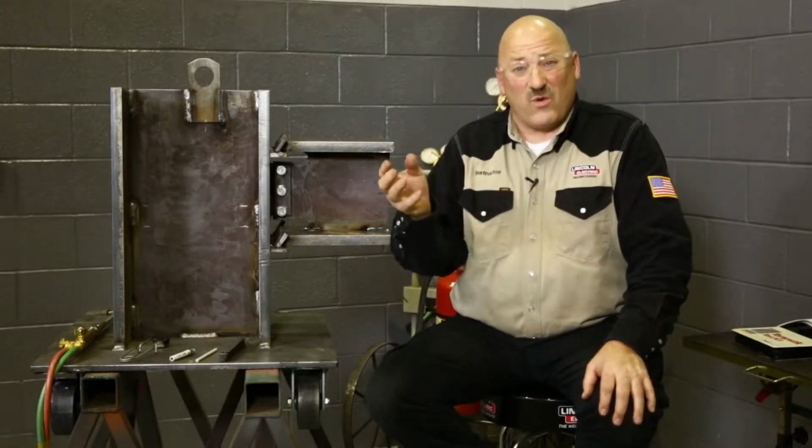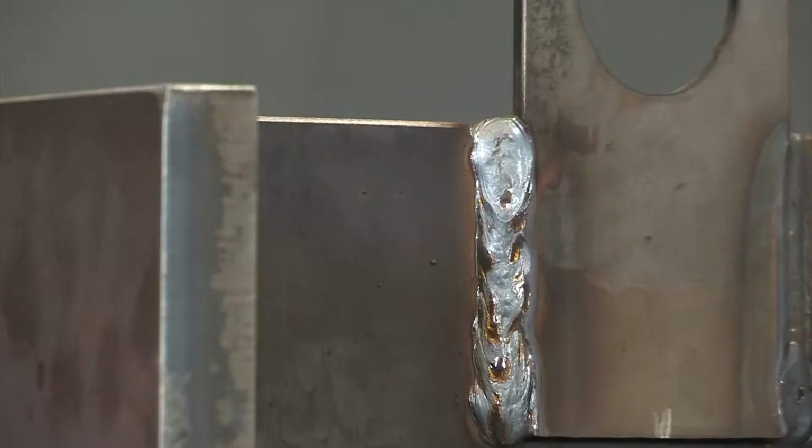And this is especially important as the material thickness goes up, like about 3/4, 1 inch thick, and as the alloy content or carbon content increase in the steel. The slower cooling rate also allows hydrogen more of a chance to diffuse out of the metal, and hydrogen sometimes, especially on thick restrained sections, can cause cracking in welds. Preheat also can help reduce residual stresses and reduce distortion, and also ensure mechanical properties such as impact properties are up to their requirements for the code.